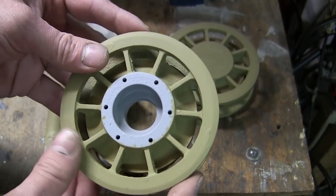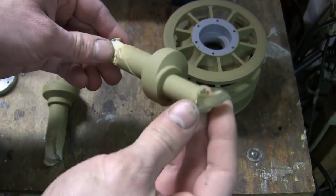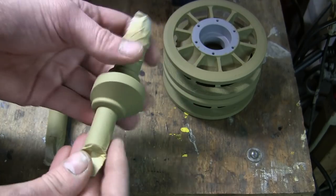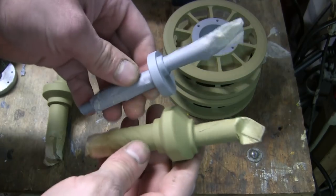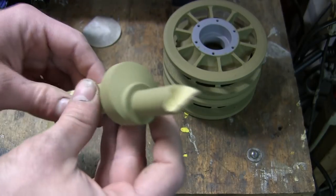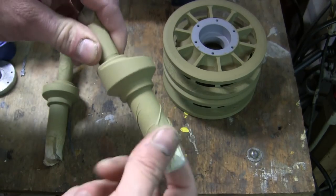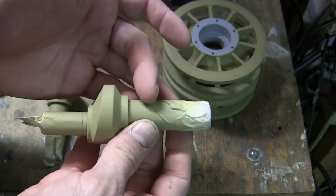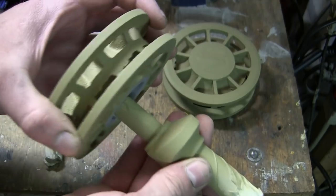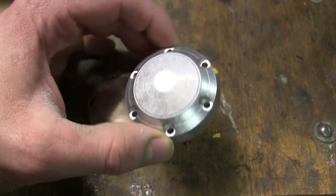Installation of the hubcap is a very simple installation — all the holes match up perfectly and the threads are all nicely represented. As for the rear idler shaft, that shaft is fabricated out of a solid piece of CNC'd steel — very heavy and very durable. In comparison with the Sherman rear idler wheel mounting plate, you can see how much more beefed up the Tiger 1 variant is, as it's designed to take the greater weight. For painting purposes, I went ahead and added protective masking tape to the axle portions of the shaft. The fatter portion is for installation to the adjustable idler system, and the thinner axle is for the actual mounting of the rear idler wheel itself. The idler wheel hubcaps are made out of a single piece aluminum turning, all done on the CNC machine.